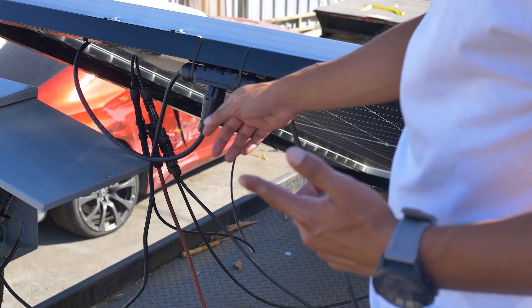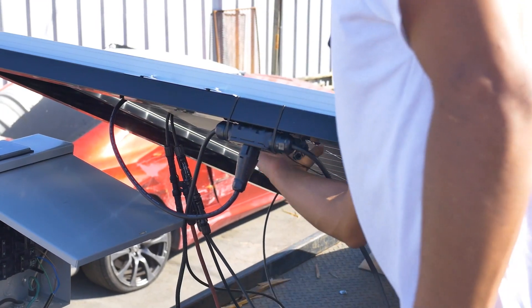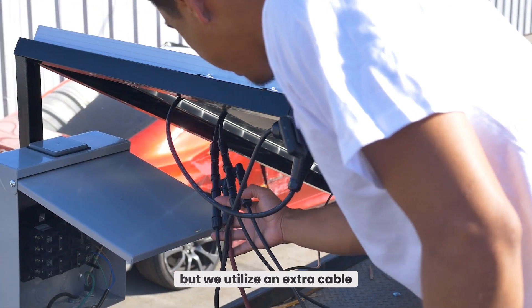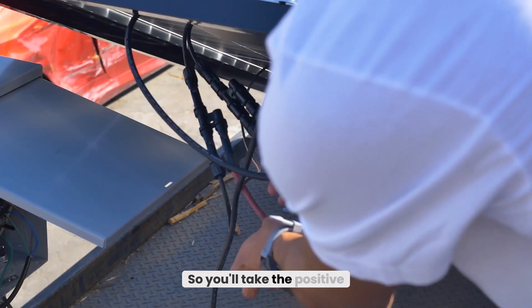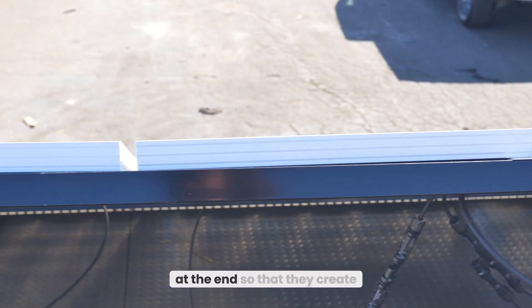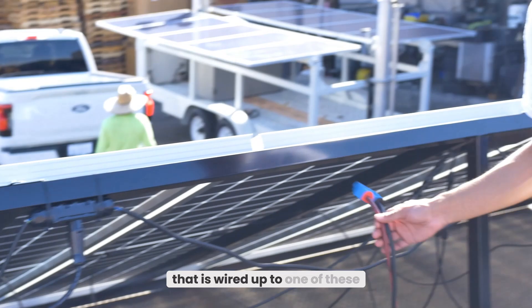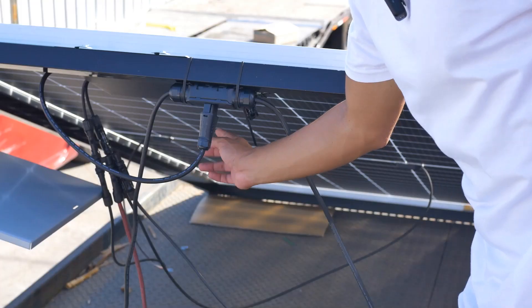We've connected microinverters to the solar panels. You can see we have these cables here, and under here we have the microinverters with the solar panels directly connected to the microinverter. We utilize an extra cable here to be able to splice the cables. You can still create a solar system wired up in series — take the positive from the first panel, run it to the negative of the second panel, then the positive from the second panel to the negative of the third, and so on. You create a junction at the end so they form an in-series off-grid DC system wired to a PV cable that connects directly to the inverter.